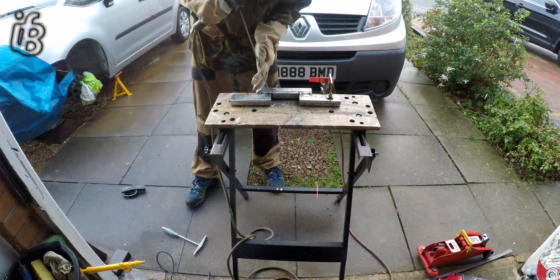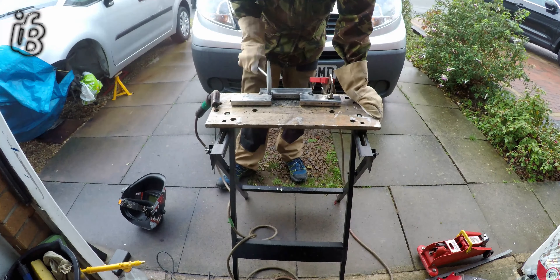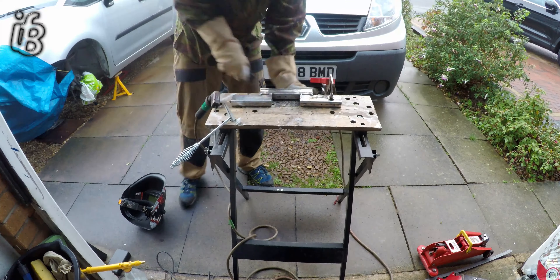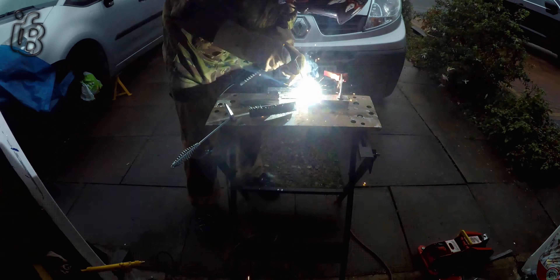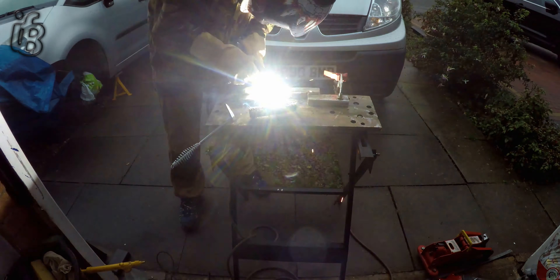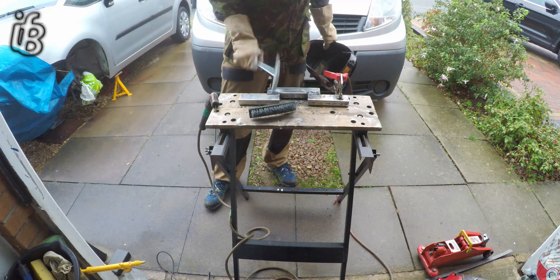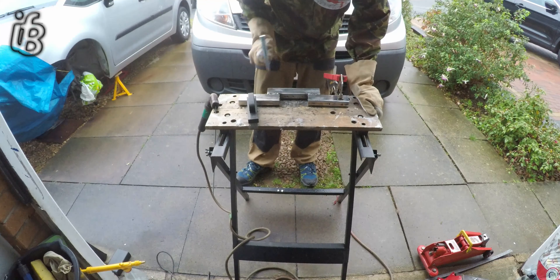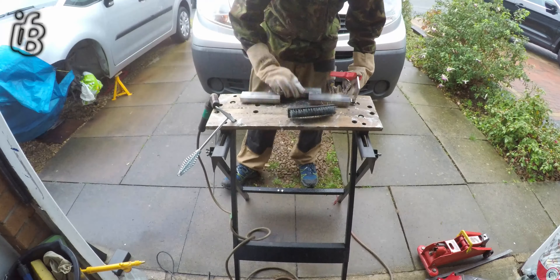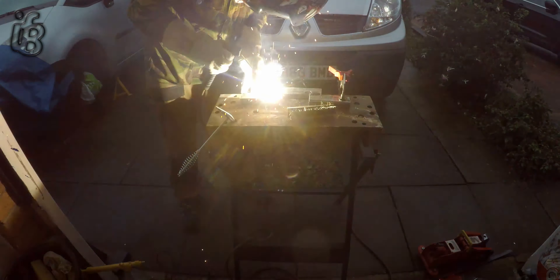Just making sure my tacks are really well held on because there's going to be a bit of weight on this — not the full weight of the car, but a little bit. A really weird thing happened when I welded it: the weld went either side but not down the middle — the left side and the right side, but the middle was completely not welded. So I went over it a few times to make sure it was completely welded. I think it's more to do with my stick angle and not driving it in there properly, but if you know another reason why this might have happened, comment below.